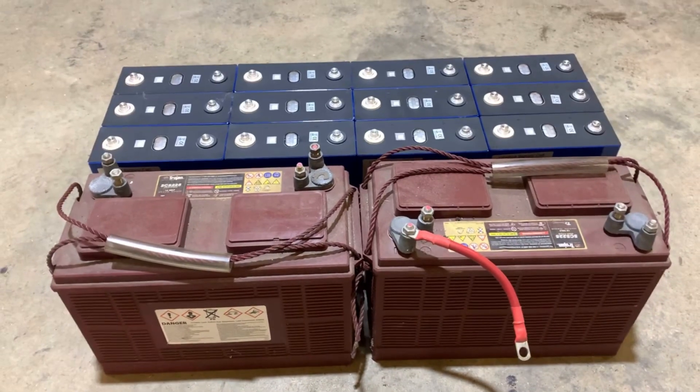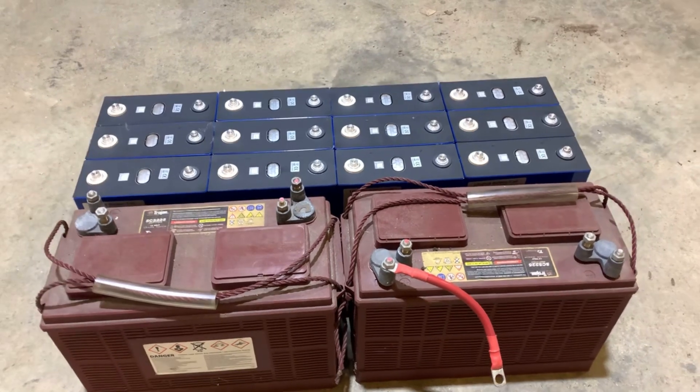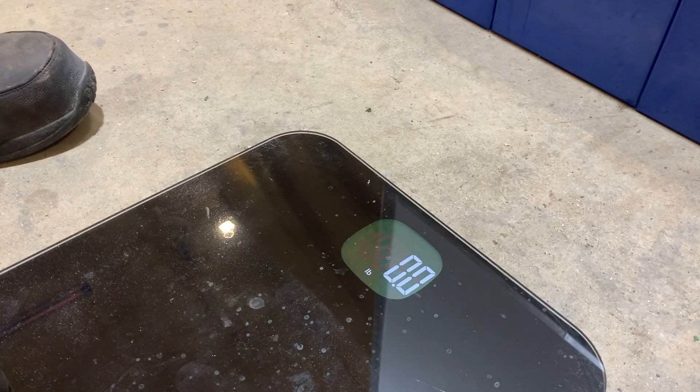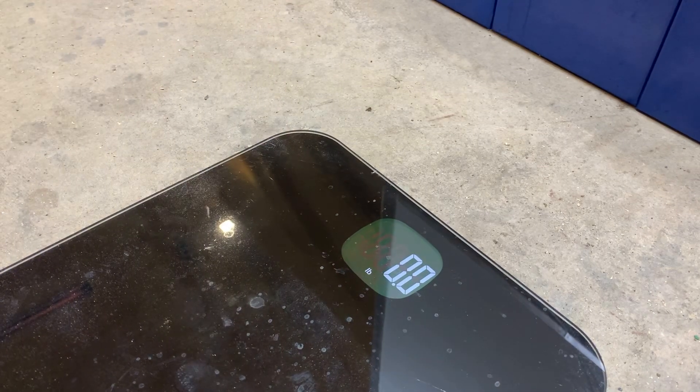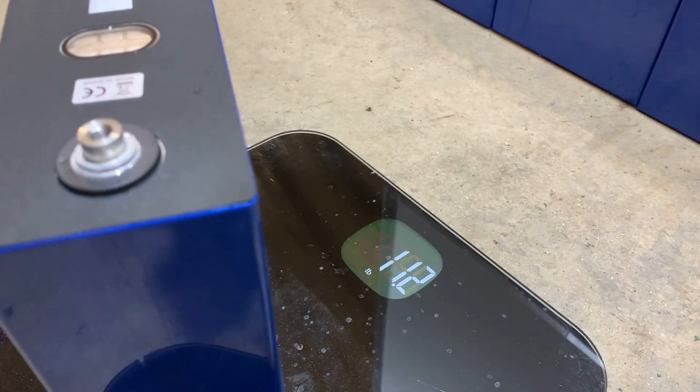As a quick comparison to previous battery technologies, these two Trojan SCS 225s have about half of the rated capacity of the same size of lithium — and that's rated capacity. You do not want to discharge those to the same level, so at a 50% discharge, those two Trojans have about a quarter of the capacity of the lithiums. Batteries are heavy though, so what about the weight? A pair of Trojans weigh in at about 120 pounds, and with 12 of the lithium cells we come in at about 24 pounds more — a total of 144 pounds. So effectively, we're talking the same physical size, 20% more weight, and four times the power capacity. They do cost significantly more money, but they also have a significantly higher expected life cycle. These are the reasons I've decided to go lithium.